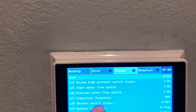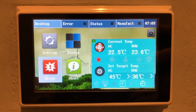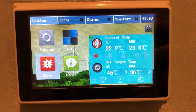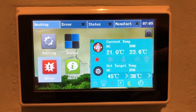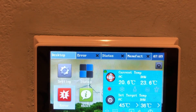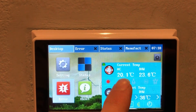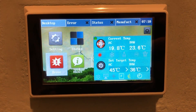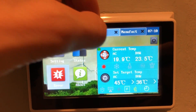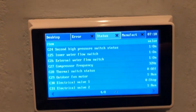Compressor frequency is currently zero because it's off. The highest I've seen the compressor frequency in heat mode is 80 Hz — it'll go higher than that in cooling mode, and I need to talk to Chiltrix about that because we seem to have a harder time heating than cooling, even though the heating capacity is technically higher at 34,000 BTUs versus 26,000 for cooling. Now we have a compressor icon — it is now heating the water. You can see the current temp starting to rise; we're ramping up. This is that slow ramp-up that's great for being on solar power.